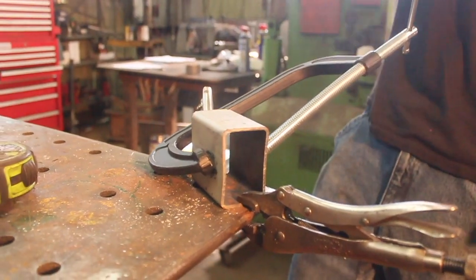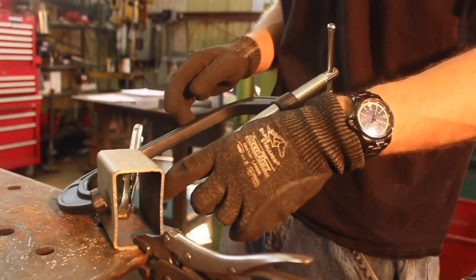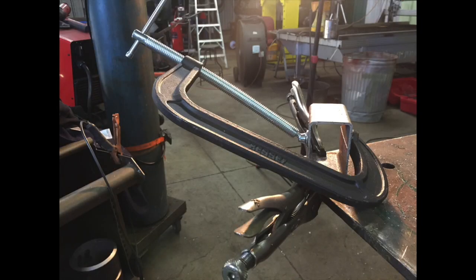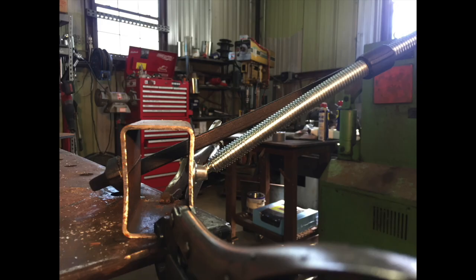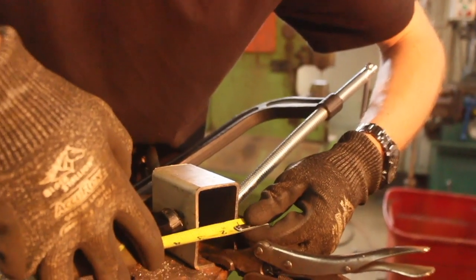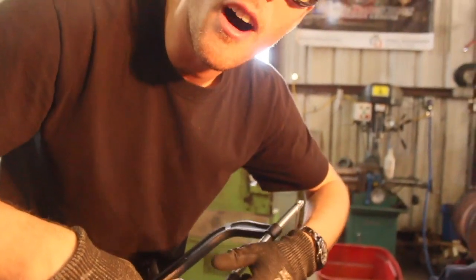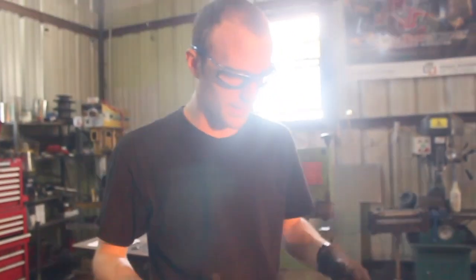This whole clamp is twisted and bowed simultaneously — the entire clamp went and this thing is tearing straight out through the side of this cap. What a total piece of junk. There was basically no deflection — we have an inch and five-eighths of gap here. All the other clamps made it all the way down to seven-eighths of an inch and were just fine. This is basically completely destroyed — it's twisted sideways.